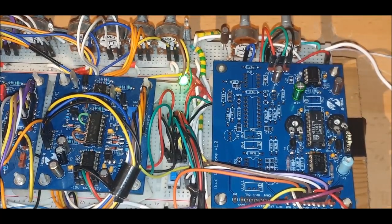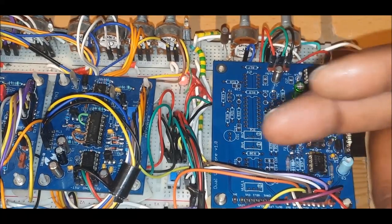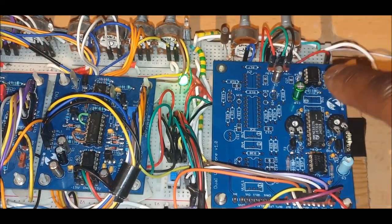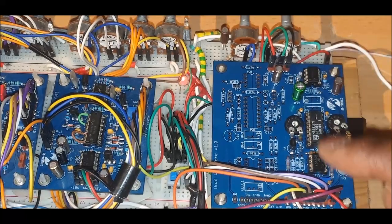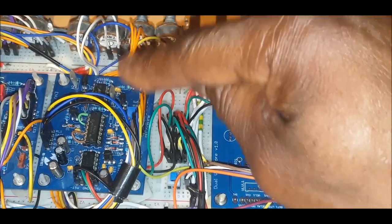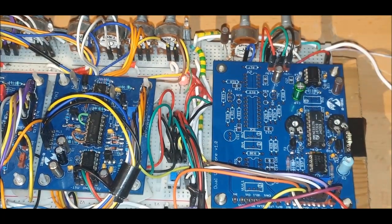It's good. It gives you a little bit of dynamics, a little bit of movement and expressiveness with your sounds. Still not 100% spot on, but it's really getting there. That will pass through to the final VCA stage, which is modulated or opened by envelope 1, or should I say envelope 2, which is over here and only deals with the VCA. That's all there is to it.